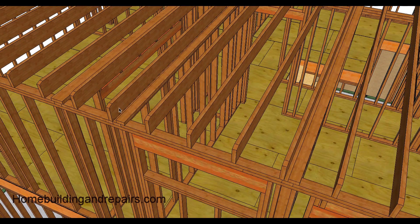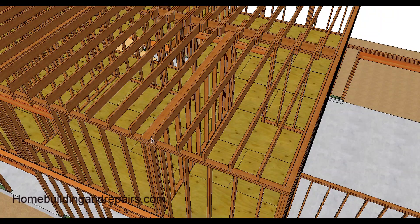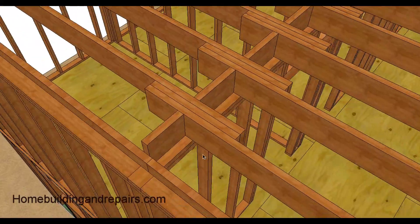In another area, we have a joist that's close enough to use for drywall backing — all you would need to do is nail a two-by-four here. Here we have the same situation: two-by-six backing, and then a two-by-four attached to the gable studs.